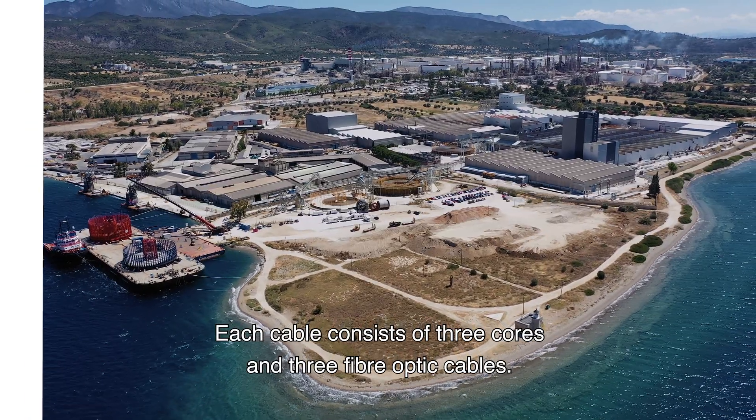In the meantime, a team of engineers works on pulling the first cable onshore at the Maasvlakte. Today we are here to pull in the first cable out of four, the so-called Alpha-1 cable. That will be the start of the sea cable campaign of HKZ. You see here the pull-in pits where the sea cable will arrive and where the cable will be split into three separate cables that will move on to the land station on site.